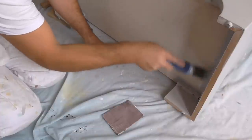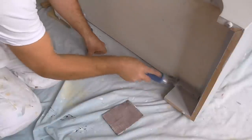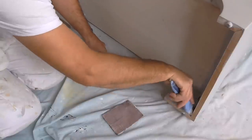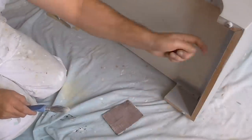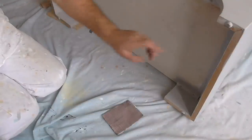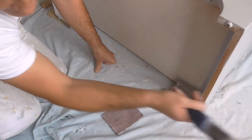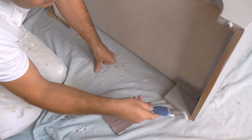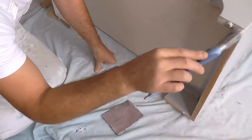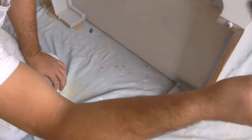So I'm not putting it back in the paint pot, like I say. I'll just use up what is left here. And also, sealing both the edges, I'm going to just bring this in as well. I've already keyed it ready, remembering that face, that side. So if you need to, come back with a cloth or just touch it with the brush like that.